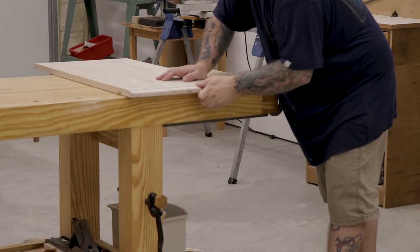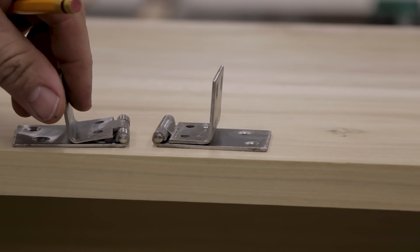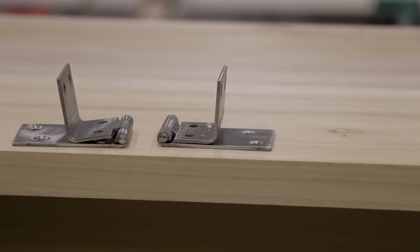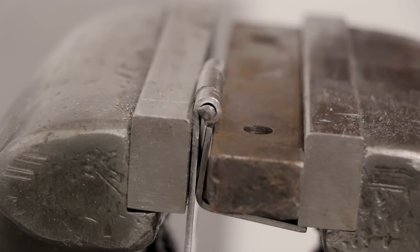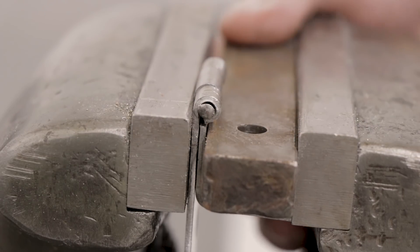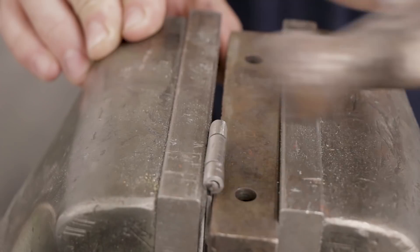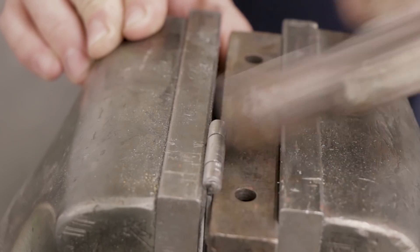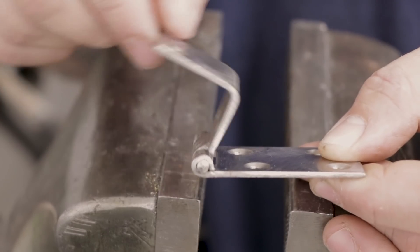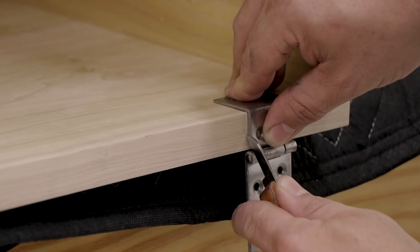I'm using some cranked hinges I picked up on Amazon for this chest — they're pretty inexpensive but they need a little work before you use them. From the factory the two halves of the hinge don't sit parallel to each other. I'm going to fix these with my vise so that I don't have to create super deep mortises for the back of the lid to sit flush on the case. I'll use my vise and an extra block of steel to squeeze the two hinge halves together, which causes the barrel to get a little out of shape, so I'll bang that back into place with a hammer. When removed from the vise you can see the two hinge halves now sit parallel to each other. Ideally I'd find some nice strap hinges, but those were about $100. These were about $10 on Amazon and just took a couple of minutes to modify. I'll leave a link in the description, and now I'm ready to start laying out their location on the case.